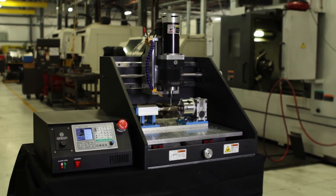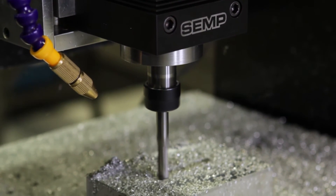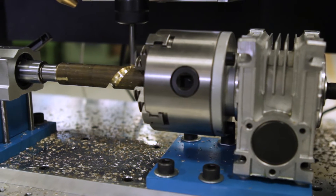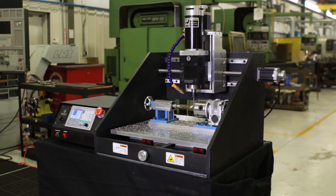The DTM 850 offers machine add-ons like our 3-to-1 gear reducer, allowing for deeper cuts with better chip loads to extend the life of the tooling. Additionally, a 4th axis option is available, allowing the user to machine the radii and angles of the most intricate parts.